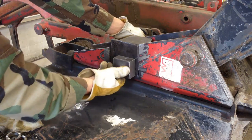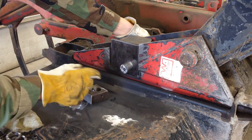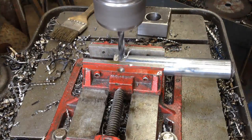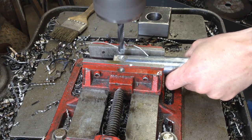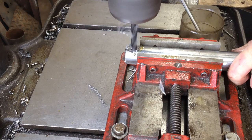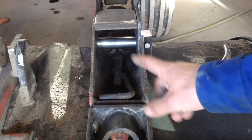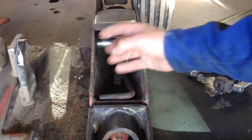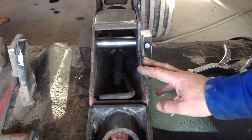Now I've got to drill a hole in that stuff. I think what I'm going to do is take the grinder and grind a flat spot to get down through that hard layer, and grind a flat spot on the other side to get down through that hard layer. I should be able to punch a hole in it without annealing — I hope. That's taking a lot of pressure though. It's kicking up the piece. I think I'm back on center — I fear I'm off a little. I was thinking another good way to have done this is to drill everything out to one inch, or slightly over, put it all together, weld it all solid, and then take the line boring rig and bore it all out to inch and a quarter. That would have been a good way too. Always more than one way to do something.